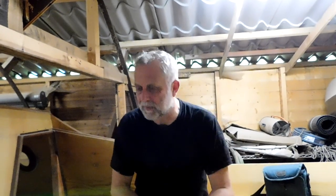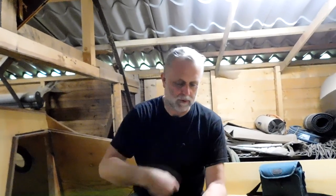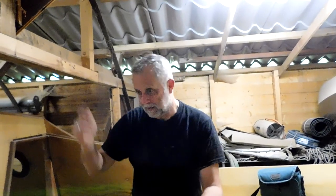And smooth it out as best possible. And then obviously with a mix of epoxy and a roller, go over that glass and wet it out. Trimming the glass as necessary with a pair of scissors and wetting it out, making sure there's no bubbles underneath it or whatever. And it comes out lovely and flat. On a flat surface, it's quite easy really to get it to come out flat, or at least mainly flat.